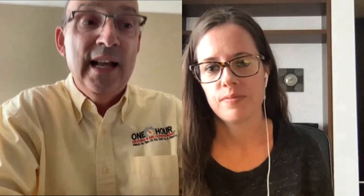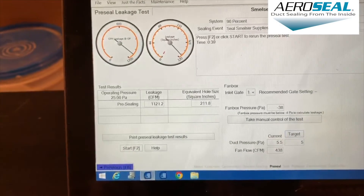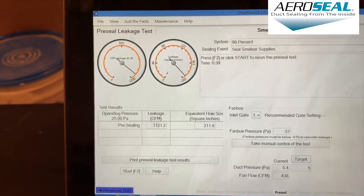If you think of taking a little piece of Juicy Fruit gum and sticking it in the corner of ductwork that is leaking, that's really what it looks like. And where there's no air movement and no duct leakage, the process just stops. As we're using our machine to pressurize the system, we can see the pressure of the ductwork going up, up, up — because it's getting tighter and tighter.